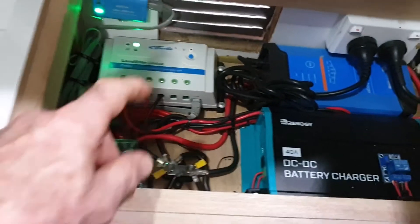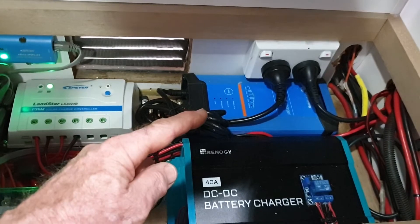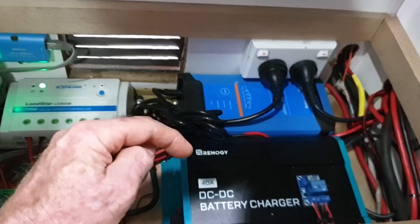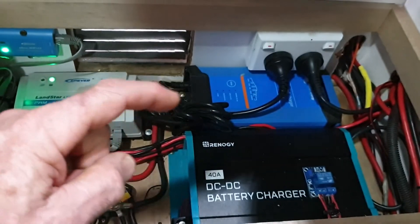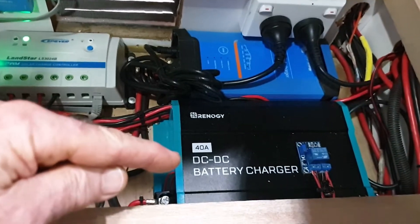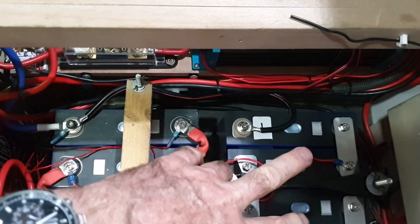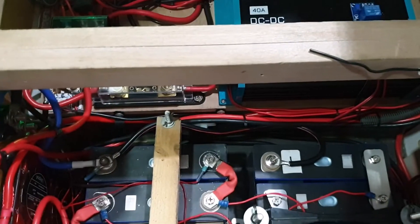So that's all you need. Cost-wise: around $40 for a 30 amp solar charger with a lithium profile — that's probably all you need. This 30 amp mains charger with 15 amp selectable was on special — that's a Victron charger, and there are other equivalent products. The DC charger was $180. Then you've got cabling and a few other bits. Batteries were $435 each when they were on special recently. And $100 for the BMS. So not a fortune — you don't have to spend a fortune.